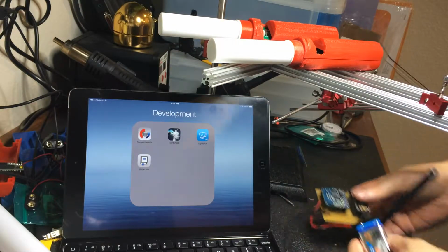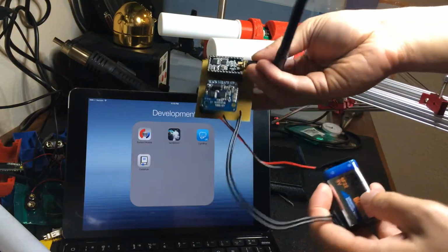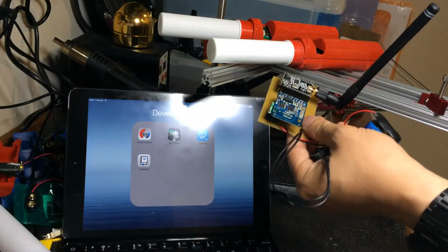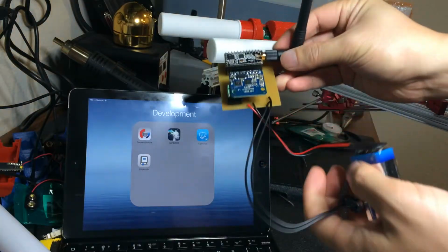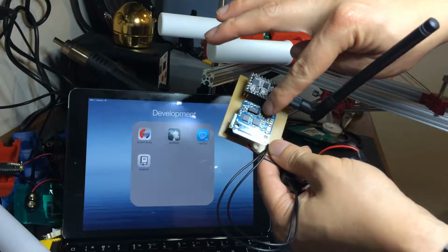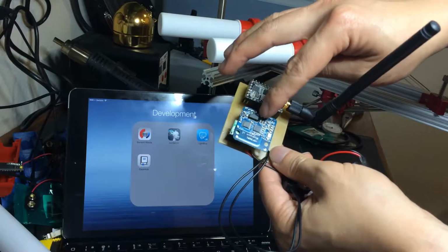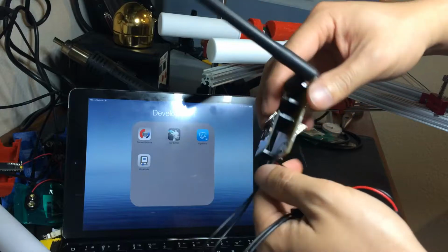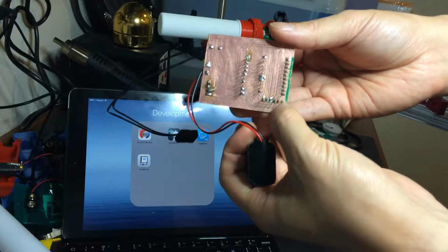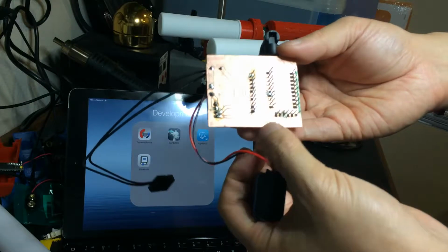Also new this week is the Bluetooth LE based master. And this is a very, very exciting development here, the Bluetooth. What I can do now is, this is a pan stamp, this is the antenna, this is the Adafruit nRF8001 Bluetooth LE SPI breakout board. And this is a board that I made through isolation routing on a ShopBot that I ran off at the TechShop last weekend. In general, I don't recommend doing isolation routing.